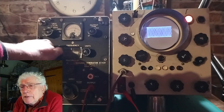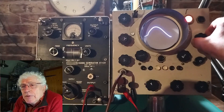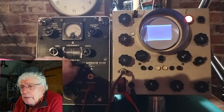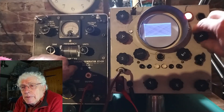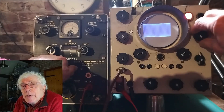There is the usual range of control potentiometers and a row of push buttons. Screw terminals are provided for Y input and external sync. A single socket on the front panel is the Z input. I've added a wire to plug into it for retrace blanking.